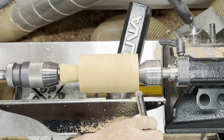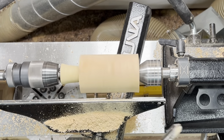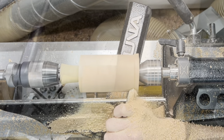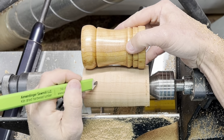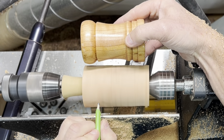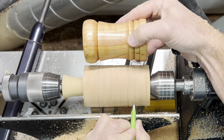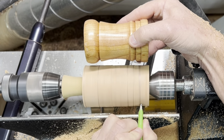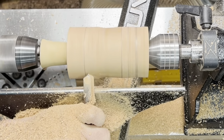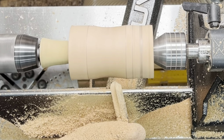So for the second run through in the microwave, I actually ran it five separate times at a minute 45 with a power setting of 5, and that brought the weight down to about 180 grams. So overall, I was able to microwave out about 53 grams of water, and that works out to roughly about a 23% drop in relative weight. And my moisture meter, which I don't have on video, was showing about 10 to 11% moisture in the blank. And that's still a little bit high, but I think that's fine for my purposes of finishing these little wooden holders for the pepper mill.